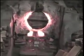Right now, we're side stoking a bit just to keep it at temperature in the back, and we're trying to keep it stable. And we're not trying to get too hot in the front, and we're using mostly pine and a couple of pieces of hardwood. Right now, it's about 1900 in the back and 2350 in the front. And we're trying to keep it that way so the pots don't melt off the shelves.